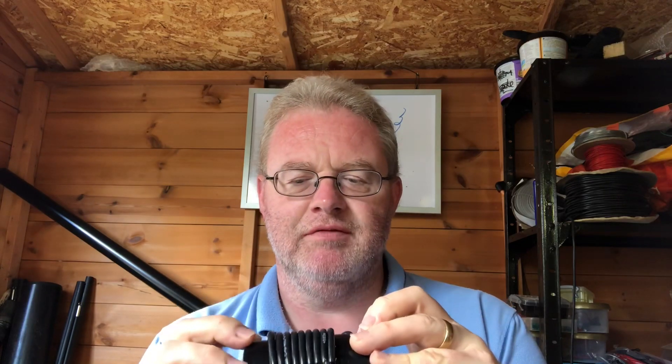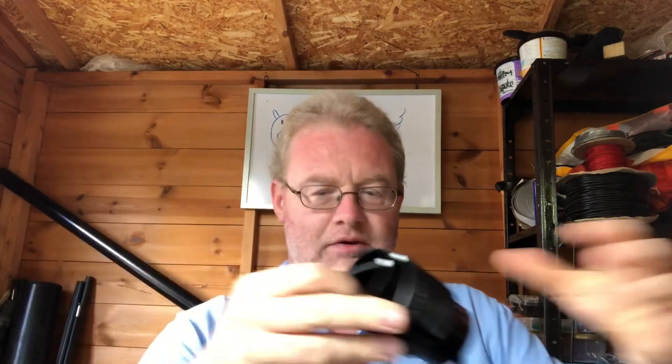The holes are five millimeter holes, about 60 millimeters apart. For the complete turns I've done about eight complete turns. This is where the antenna leaves — I made a little mark with a piece of tape because I measured down to 91 centimeters. What you then do to make the choke is you feed the coax up so the end of the main antenna is out of the way, and then you're left with the remainder of the coax to wind around. For this I used about 10 meters of coax.